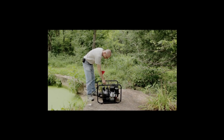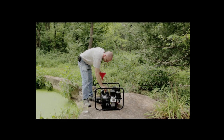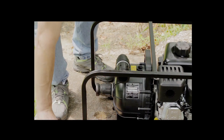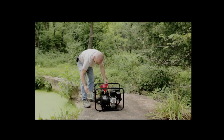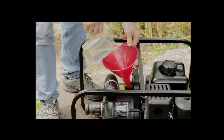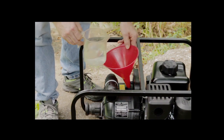When first installed, it is necessary to fill the pump with liquid in order to provide the initial prime. It is not necessary to fill the suction line. To give the pump its initial prime, first remove the priming fitting on top of the pump casing, fill the pump casing with liquid, replace the plug, and then start the pump. The shorter the suction lift, the faster the pump will prime.